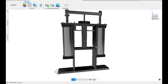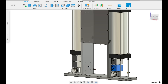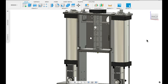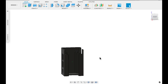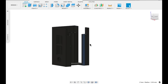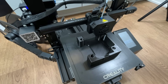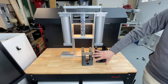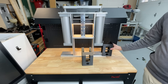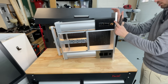The mechanical assembly is done, so let's work on electronics. We created two custom black enclosures designed to hold four PID temperature controllers, even though the heated chamber can accommodate five temperature zones. The long holes also act as spacers between the base and the bottom of the pneumatic cylinder. We 3D printed these at 100% infill for rigidity — they turned out really nice. These slide into place and are held by long screws which also support the bottom of the pneumatic cylinder.